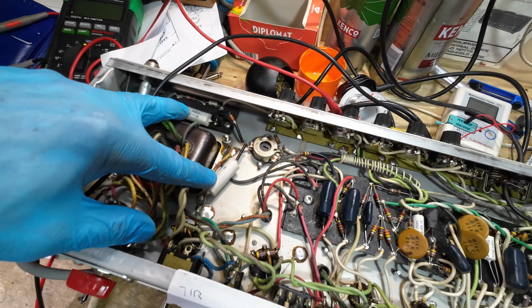There you go, and you can see that voltage is creeping up again. That's not really made a great difference, but it's made some difference on the scope. It used to be glowing quite a bit. Just check that choke, it's not getting warm. 270 milliamps now, we've got 208 plate volts, 134 now. So what we're going to do now, I'm going to stick a 100 watt bulb in.